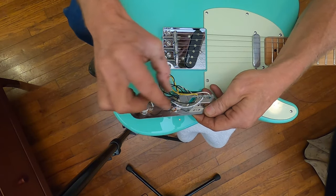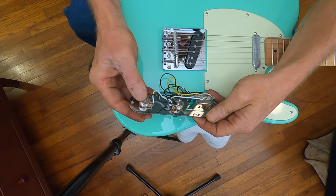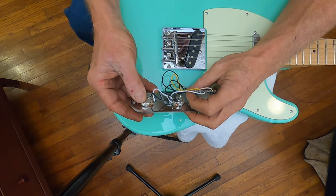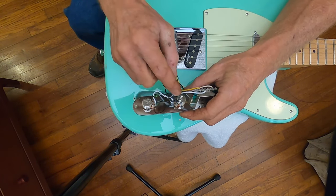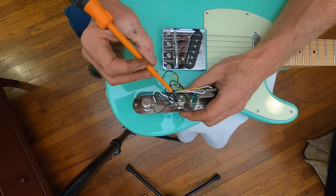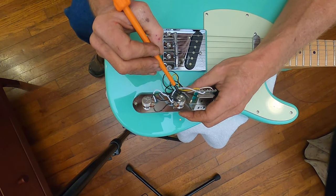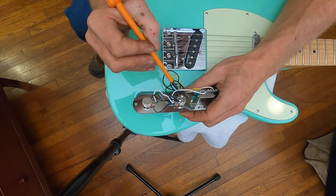Pots are marked CF. And it looks like the soldering is very well done. We have three wires right here that are soldered onto that pot. And this puddle was done all at the same time. And there's a nice sheen to that puddle. We have two going to this one, and again, a very nice sheen, nice bond.